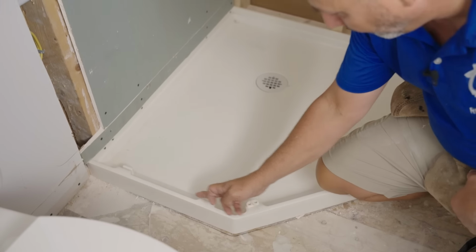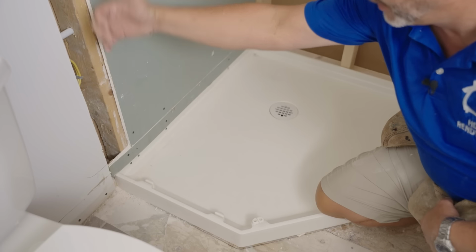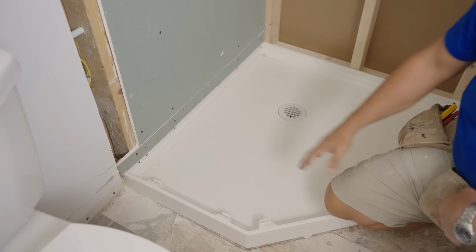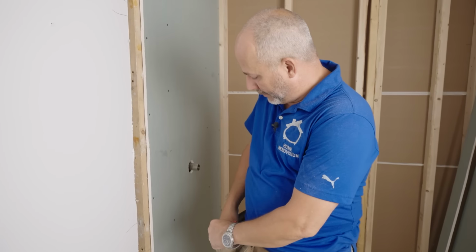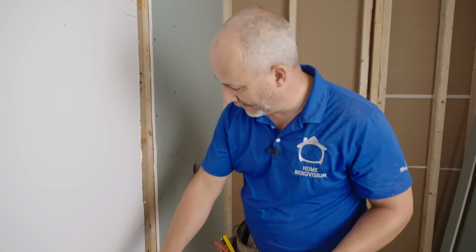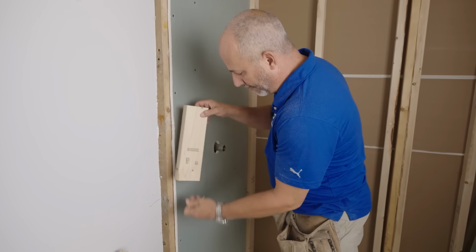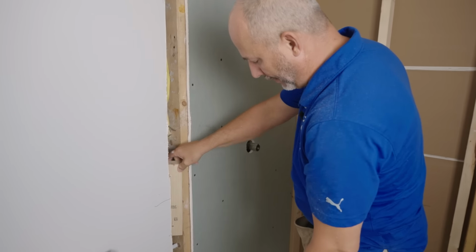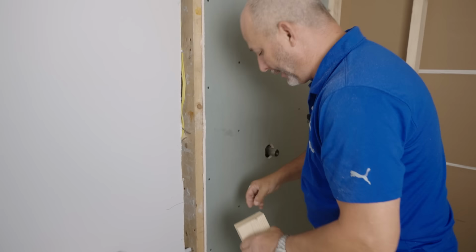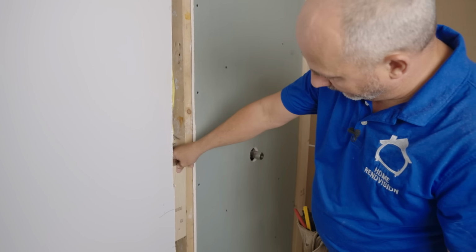Now, when you draw the line through here, this is the point that you're gonna be installing your U-channel that holds your wall panel. So we've got to have blocking there. Because this is a very busy mechanical wall, I've gone ahead and cut some blocking, and I'm going to take the time to pre-drill some screws where the blocking goes on an angle, so that I can put this blocking in on the flat and still have it screwed flush to this wall. I know there's nothing on the other side of the stud, so if I came through this way, I run the risk of hitting something. So we'll go that way. It'll be a little bit of a pain in the butt.